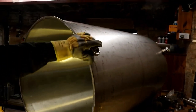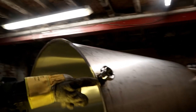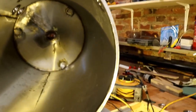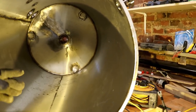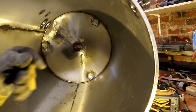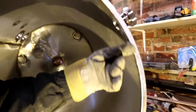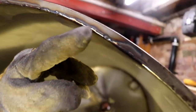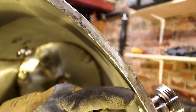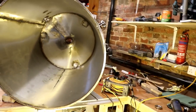Four fittings are on there. We've also got the two fittings on this side — that was a bit tight so I had to weld it from the back. And then what I'm doing now is just hitting everything with the grinder — buff and polish all the inside. What I want to do is get it finished as I want it finished, and then this doesn't have to come back on the bench again. Just running around the edge so I've got a nice smooth edge — get rid of these little weld marks and smooth it off. That wants to be a nice smooth edge for the top to seal nicely on it.